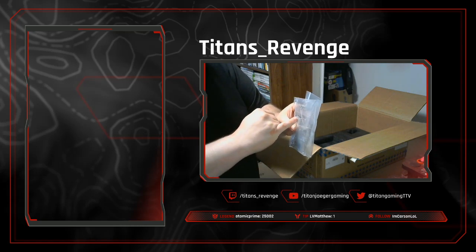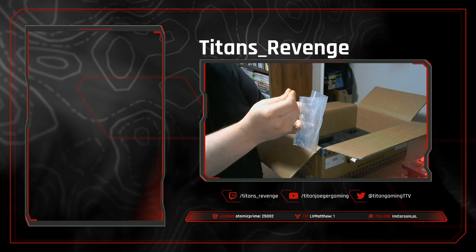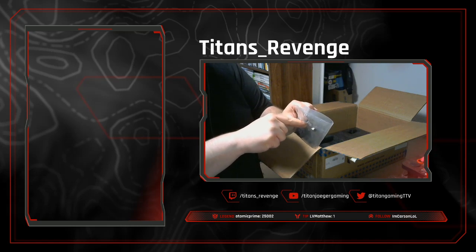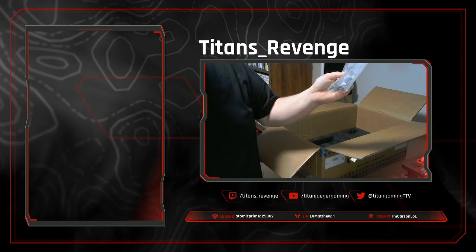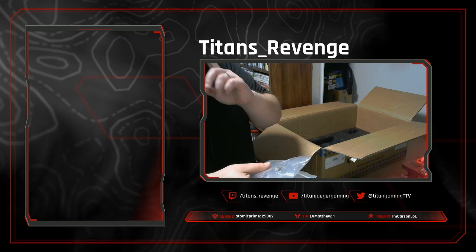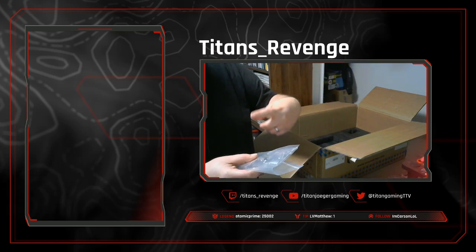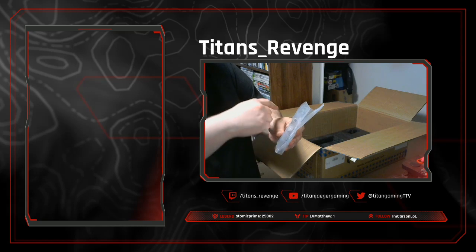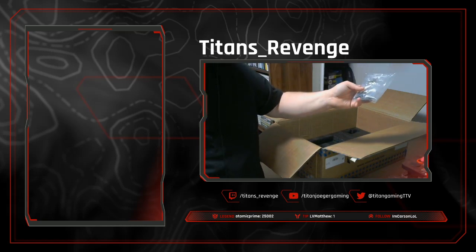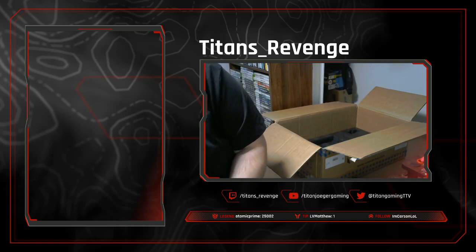The problem is that through every print, it's moving back and forth like this. So eventually these little plastic teeth in here wear down, and it just lets go of your tube. And then all of a sudden, your print doesn't stop feeding. You're still getting all of the filament, but it's not going into the hot end, and so you end up with this huge mess of, you know, spaghetti, so to speak.